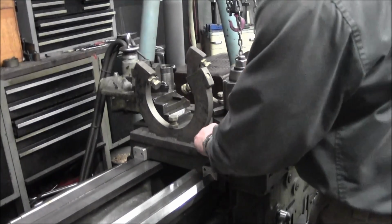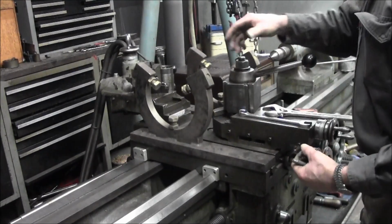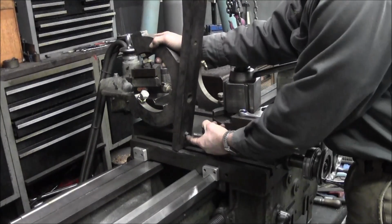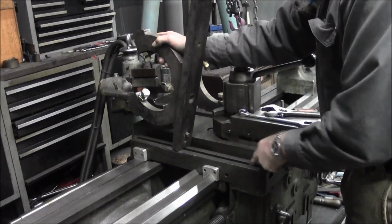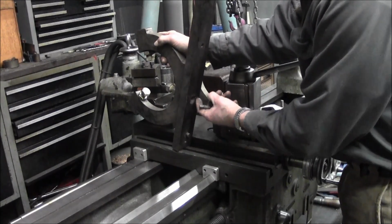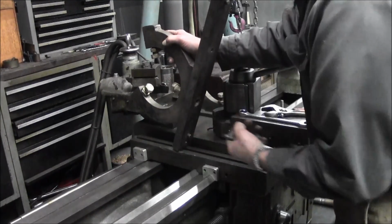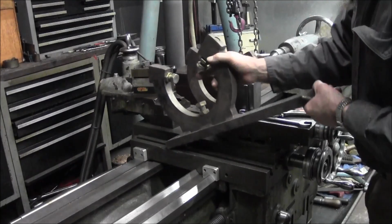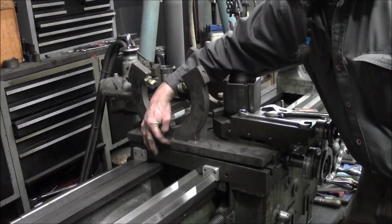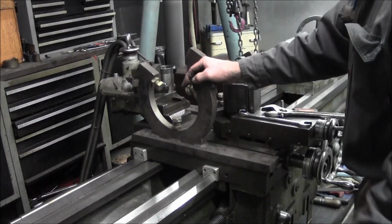Alright, we've got our 2 cradles up here, and we're getting ready to bolt them down to our carriage. And underneath here, when I built these, I incorporated 2 pins that line up in the slot. And this is an opening here that allows screw clearance to give the drop I need on the center pin once in a while for the extra travel that's down in here, instead of having it dead out, so I can have the larger swing if I need to.